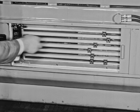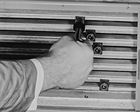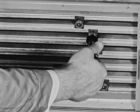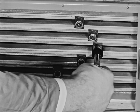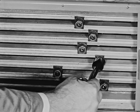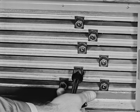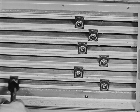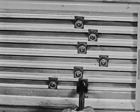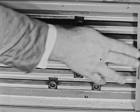Limit switches are located behind sliding panels at the front of the machine. Limits are set by adjustable dogs; movement of the carriage causes the apron switches to contact these dogs. Quick and positive setting of the seven stops is provided by signal lights that glow when contact is established between the various dogs and their corresponding switches. One reason for the short setup time of this automatic is the ease of setting these stops.